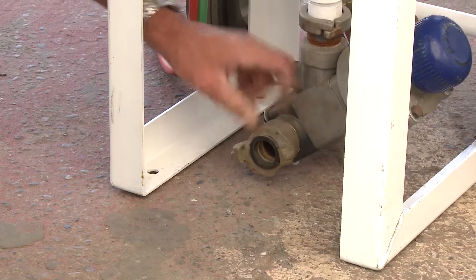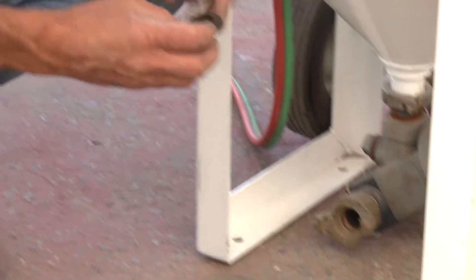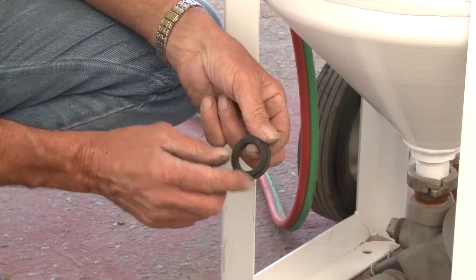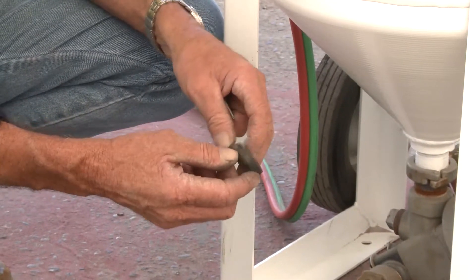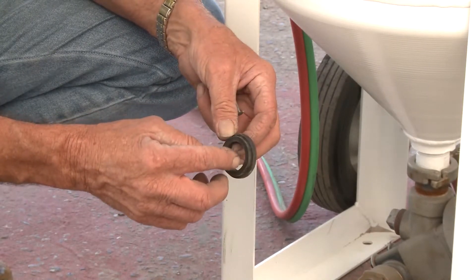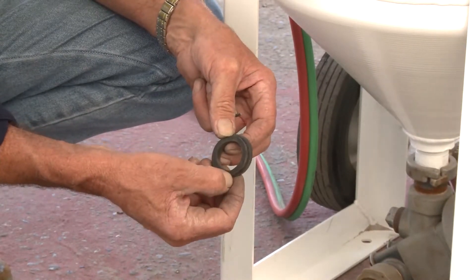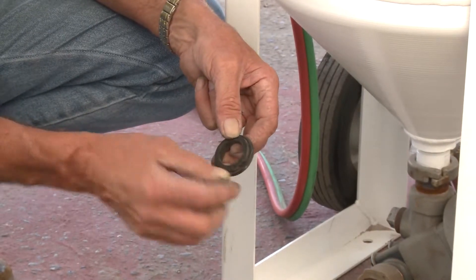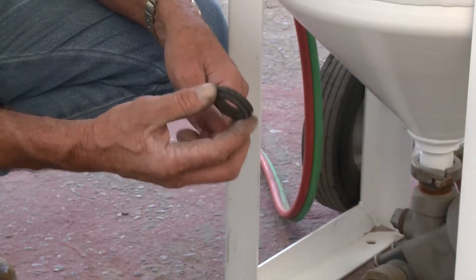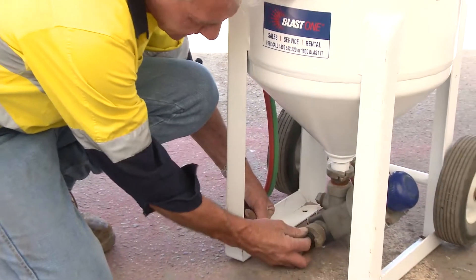Here's an important note: inside this coupling is a small thing called a gasket. It's imperative that this gasket is checked every day, or at the end of each blasting day. You check the gasket for its concentric value, the face of each side of the gasket, and also if the gasket has been under stress it'll tend to cut one side out of the gasket — you'll see it quite clearly where it's been undermined as far as its wall strength or face is concerned. So this gasket is checked every night.